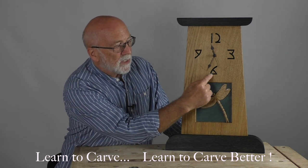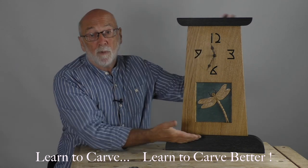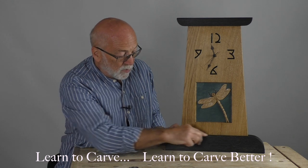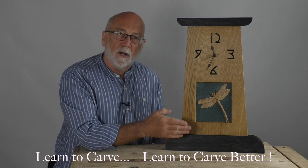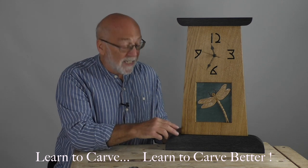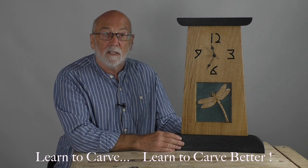We've also got an Arts and Crafts style numbering here. The whole piece is simple woodwork — it's just three bits put together with dowels. This bottom bit is the same wood, only the oak has been ebonised — in other words it's been given a treatment with a wire wool and vinegar mix that produces ferrous acetate, and that gives this fantastic ebonising black colour to the oak.